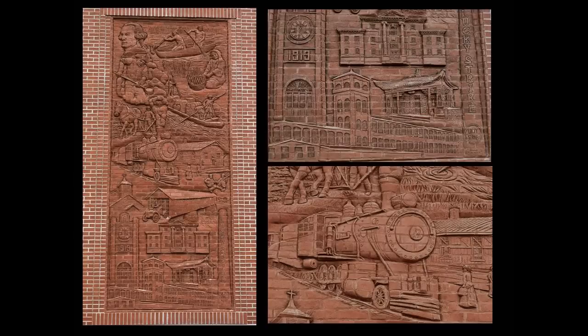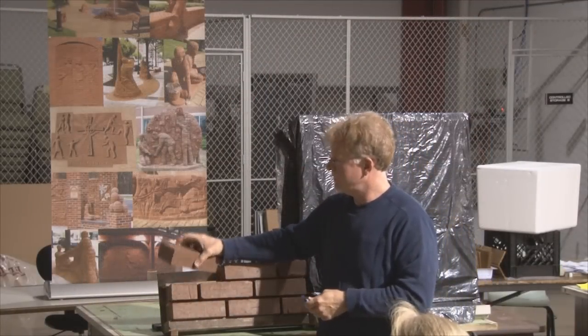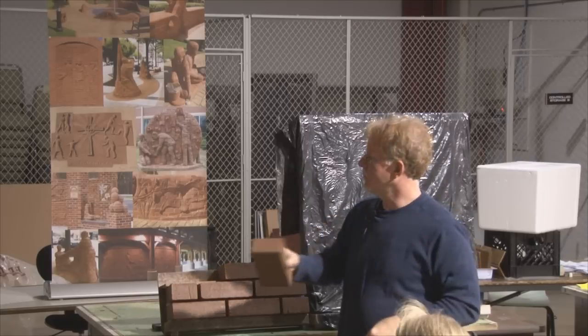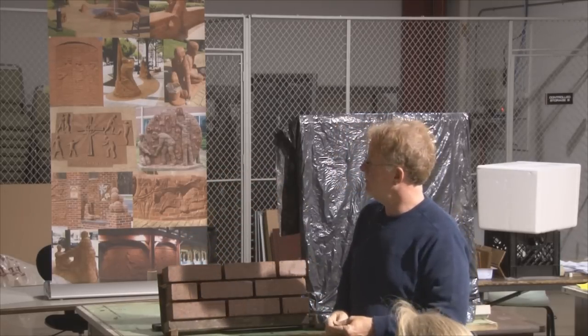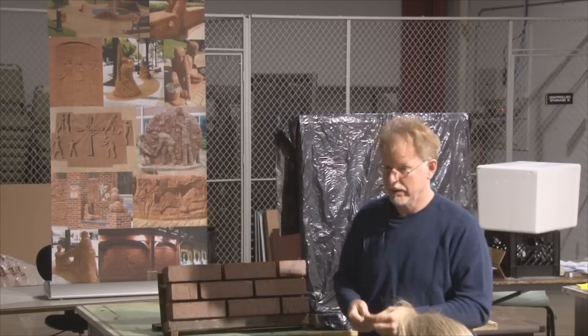Oh, just more details. We added this one because you may have seen it. This is on the courthouse right down the street here. Again, a historical montage, and we just have one of the panels shown here. This is a little bit lower relief. It's done in one wythe of the brick, which is this deep, and you only have about 2 inches to work with. So the deepest part of this is about 2 inches deep. So it's not as deep as the one you just saw. So this would be a bas relief.